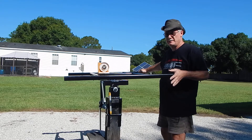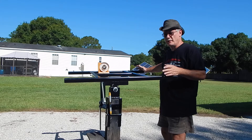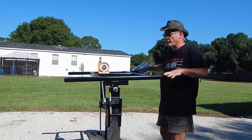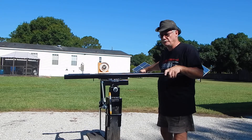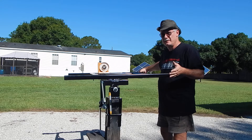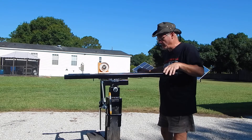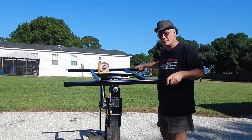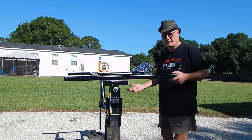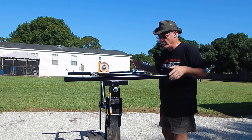These are set up for six solar panels, between the 250 and 300 watt range. The width is all the same on those solar panels. The first two you put on the north and the south will ride on the frame, and the others will go outward. The 250s are like 39 by 65 inches, and the 300 watt ones are like 77 inches tall but the same width. You have to mount your pole high enough so the tilt axis will work properly. I always recommend putting the pole at least six feet off the ground — it's handy because I can just mow around it.